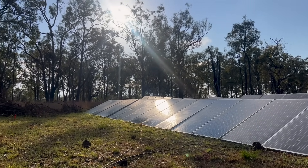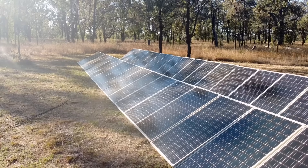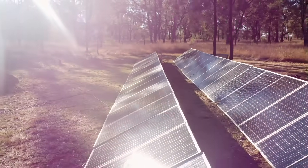Because I was pointing a little bit northwest, that meant the sun was coming up almost behind the solar panels as we got into summer. I was getting shadows from two trees positioned right behind the arrays. I thought I could back those arrays right up to those trees with no worries, because they were south of the arrays — they were never going to cast shadows forward. But in the morning hours, particularly up to about 10, 10:30, I was getting shadows come straight down onto some of our solar panels. We've got older panels, which means partial shading is a massive consideration — if one panel is shaded by 20%, it's like the entire array is shaded by 20%.